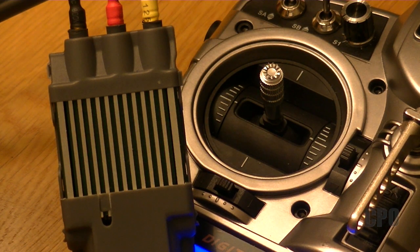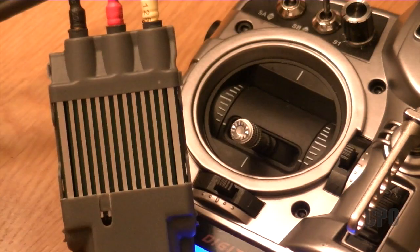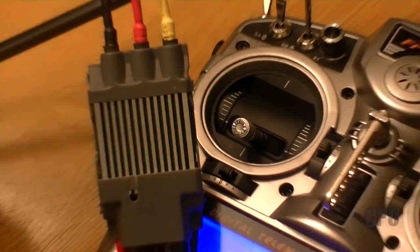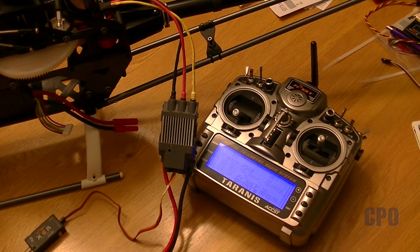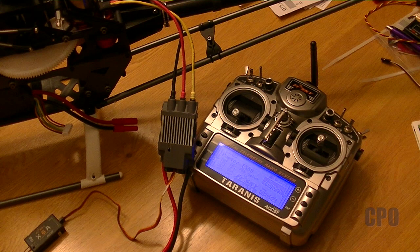That's the last of the stick programming settings we have available to us. We get that final tone that tells us we're basically out of programming mode. We can go ahead and unplug our ESC and we've completed the stick programming. Through this question-and-answer session, we identified our low voltage cutoff voltage, what type of braking if any, what our low voltage cutoff type is, and what our PWM switching rate should be. We've calibrated our throttle high and low positions and made some very basic adjustments. I hope that was helpful — thanks for watching, and I'll catch you on the next one.